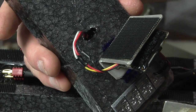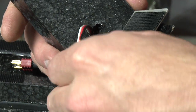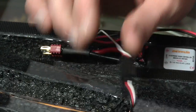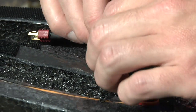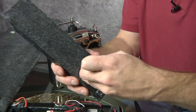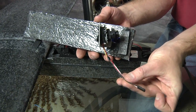Video feed coming out of the camera — again, just like the transmitter, same thing: ground, 12 volt power, and video. And again, a servo connector. Very, very simple, very straightforward. That's all there is to it. Just wire a servo lead in.